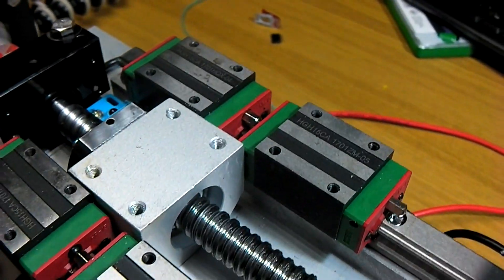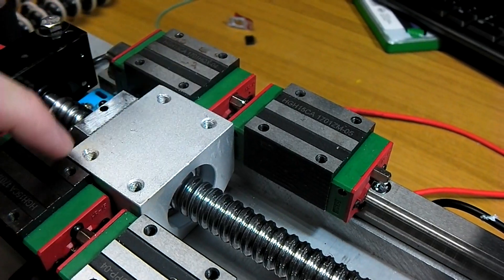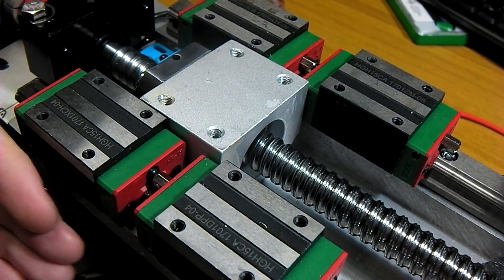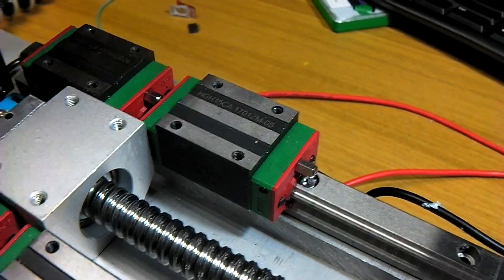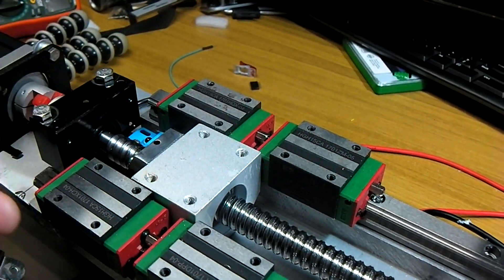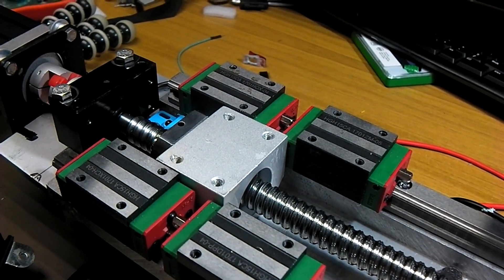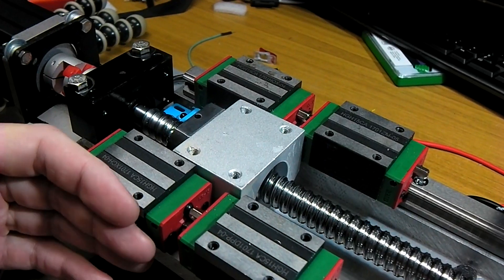A lot of the distances are fairly tight. As you can see here there's not a great deal of distance either side, and there's not much wasted space on either side. The idea is to keep the compaction so that you don't eat up too much of your Y movement or the gantry axis movement, because these will hit the sides of the gantry.